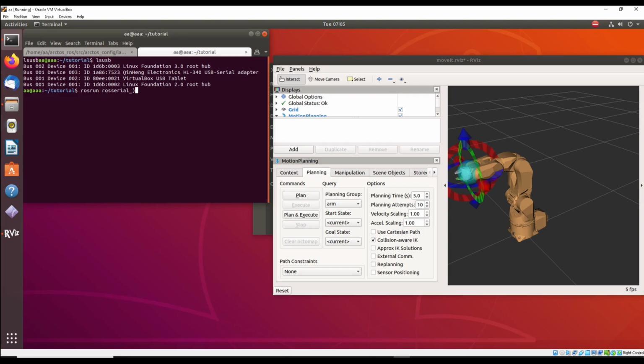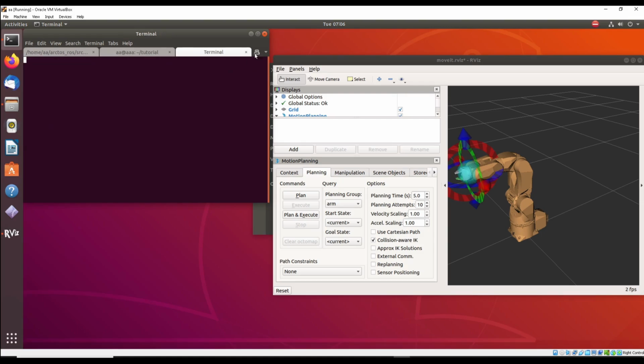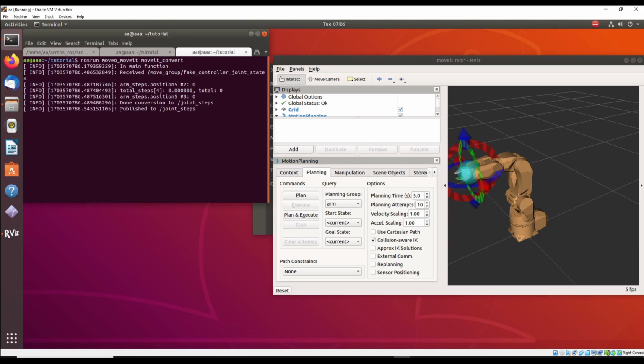Run the ROS node to establish a connection with the Arduino. Two subscribers for the arm and gripper will be visible. In a new tab, run a ROS node that reads joint angles, converts them to step counts, and publishes the counts to a different ROS topic. Now, the real robot will mirror the actions simulated in Rviz.